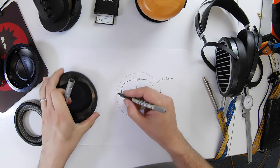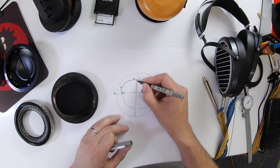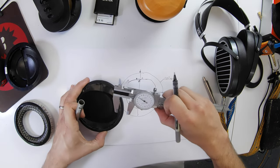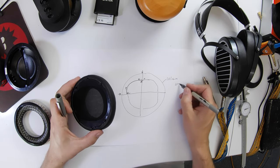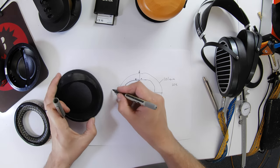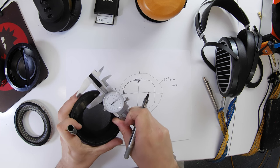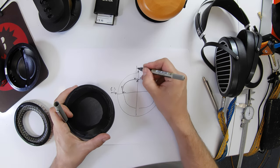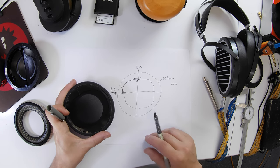If I was being super fussy I'd take measurements off the actual driver, but we're basically reverse engineering this piece because we know that works. So we're going to need the thickness here and here. That is 9mm, but because we've reduced the outer diameter from 102mm to 101mm we need to take half a mil off each side, making it 8.5mm. The top measurement is about 20mm — we'll make it 19.5mm.